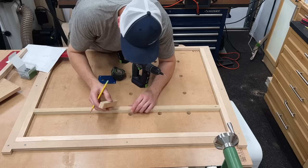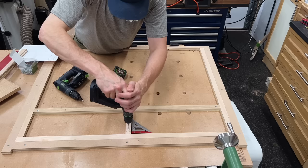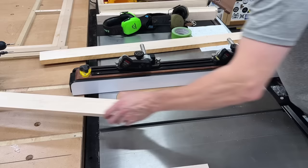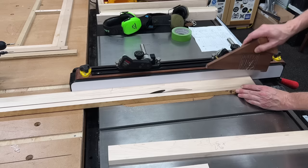This did take about 10 or 15 minutes, but to me it was well worth the time. I just took some scrap plywood, ripped it all down to the current widths of the face frame, and fit it all together by screwing it to my workbench. Then I could get started ripping down all my rails and stiles to width.